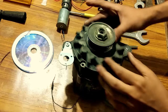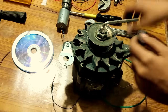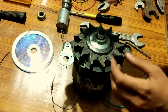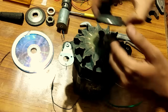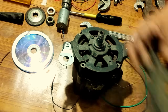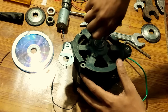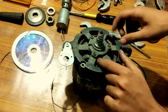So what we are going to do is open this up first. Your alternator is like this now. You can see the inside field winding that is rotating, and that field becomes an electromagnet when the input supply is given to it.